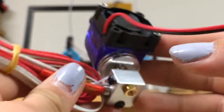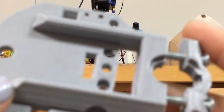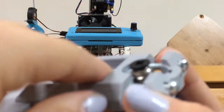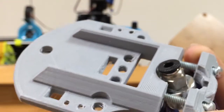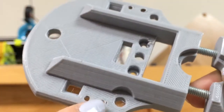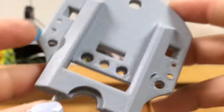It's really easy to assemble — it just comes in and screws all the way down. Before you set it up on your printer, you want to make sure it is really tight. You also need a new bracket. I'm using the Tevo Tarantula, so I did have to print a new bracket. This bracket just goes in here and then you tighten the screws. This becomes the base plate with only three screws. On the outside, this is where the belts go and this is where the end stops go. I'll do a full assembly later in this video.